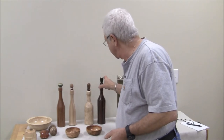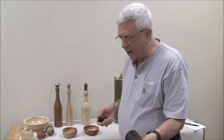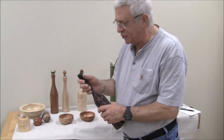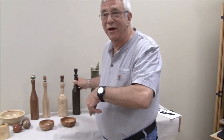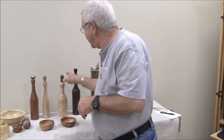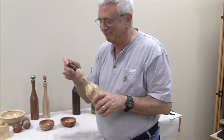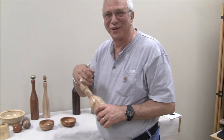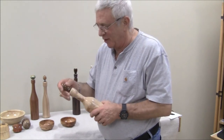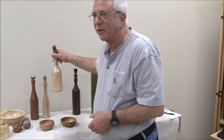Jimmy's got another convert here. This one's Indian Rosewood, and it happens to look really neat with the ebony stopper. Somebody asked if it's hollowed the whole way down, and I said yes, sanded too. It's hollowed down with a Forstner bit. And depending on whose stopper you use, sometimes they bottom out, so I learned to bore it deeper. But this was an expensive piece of wood and I'm just absolutely thrilled with it.